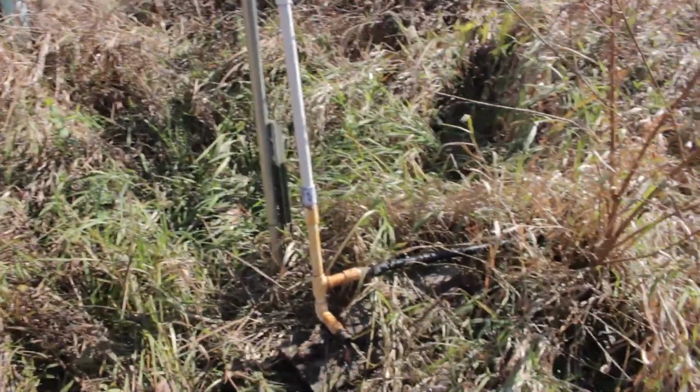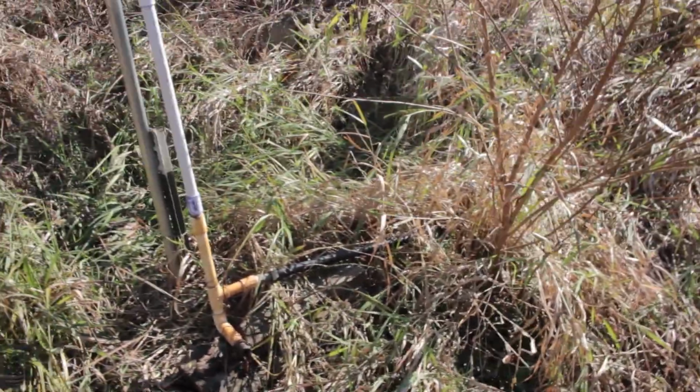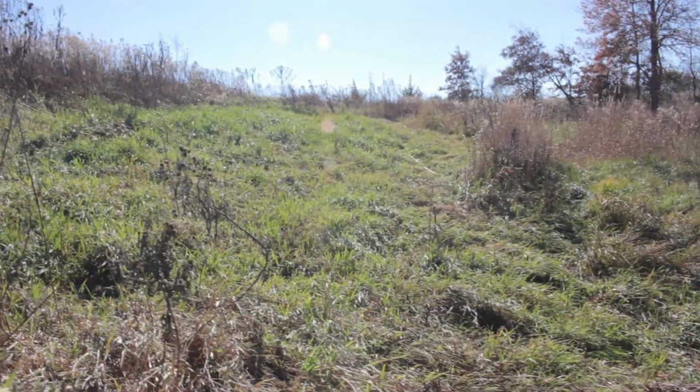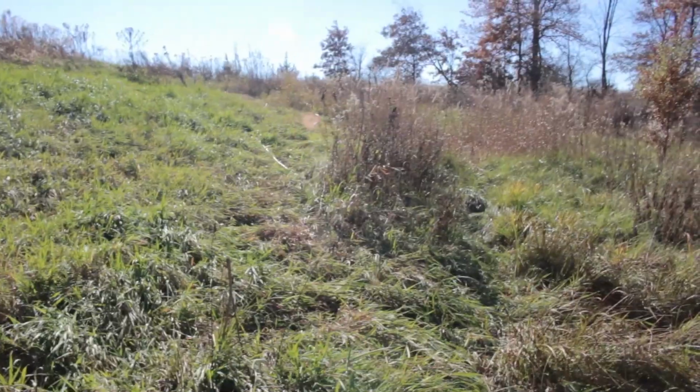And then if I turn this hydrant on, I'll get the flow coming out, and it's basically just like, we'll fill that pipe all the way up to the surface of the pond, and then the pump pumps it from that point into the pipe and then pushes it up, so it doesn't actually have to draw. It's much better when you're pumping water to push it than to pull it.